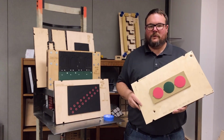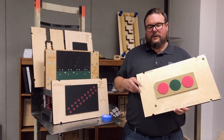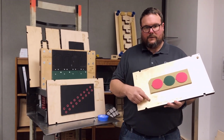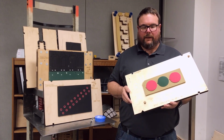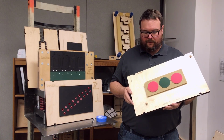Here's a few tips for when you're working with steel rule dies on a Preco flatbed die cutter. Should you not have quick change tooling clamps, no big deal. You can just use these holes positioned and you can bolt your die directly into your ram plate. It's very simple, just not quite as fast as the 5-second changeover.